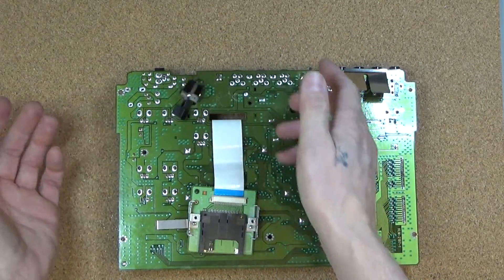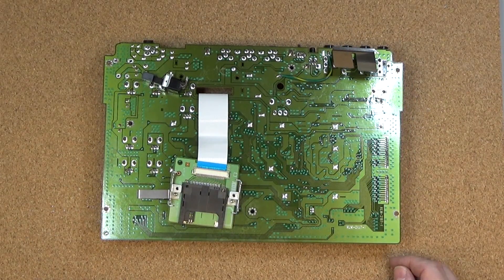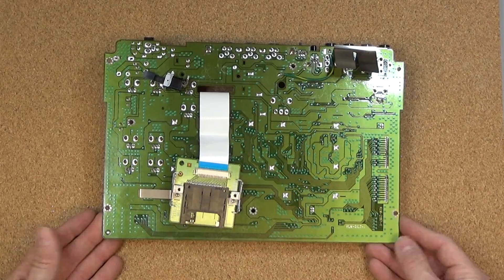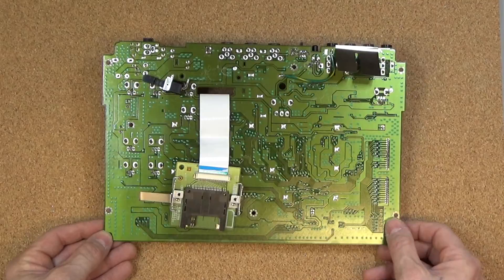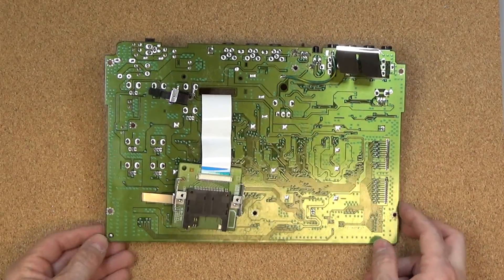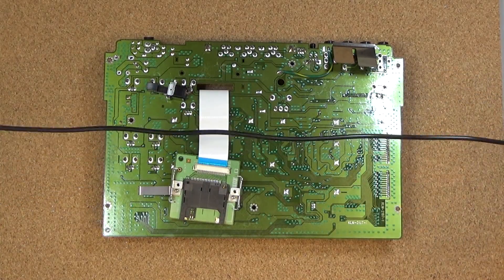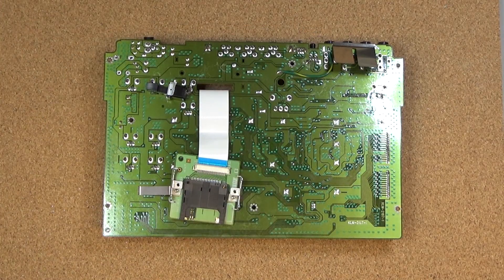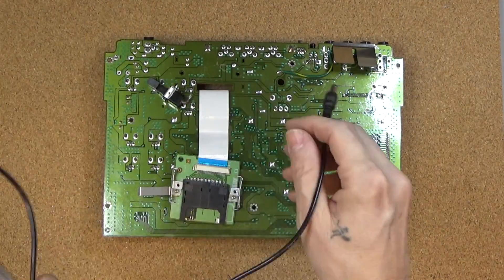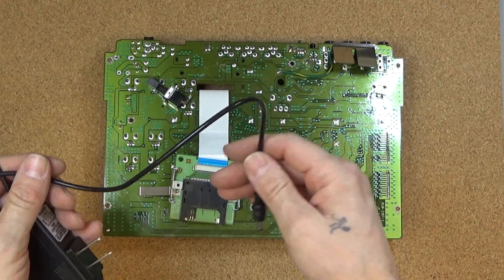That's the deal. As far as I can tell, a lot of music equipment seems to be in that area more than anything else, because they seem to like to switch these around. So watch out for that. Now I got to fix it. Here's what I'm going to do: I was thinking I'm going to cut this cable here and flip the things around, because I don't have a reverse polarity nine volt brick. So I'm going to cut it, flip it around, plug it back in.